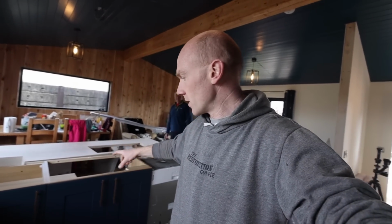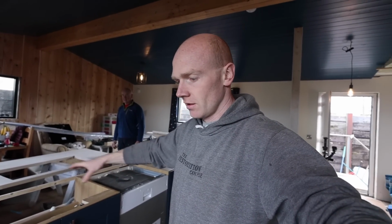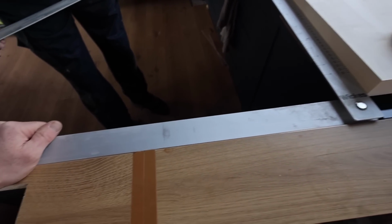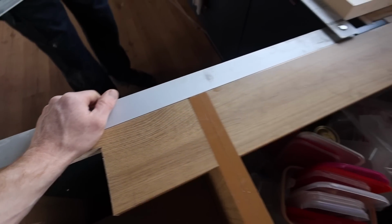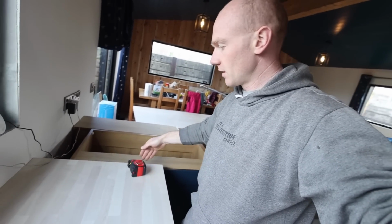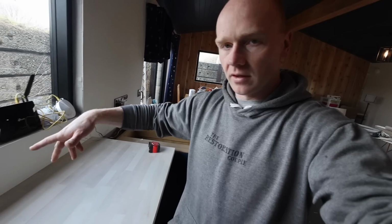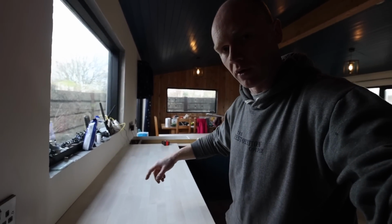We realised that we never really squared these cabinets here to the other ones, so we just shifted them across as one, and the dishwasher will fit in later, and then that just means that we can now make sure that this join is going to be nice and tight without having to scribe everything to the wall, even though the upstand will cover a lot of that.